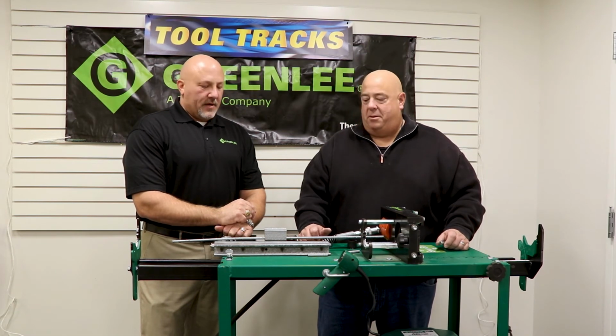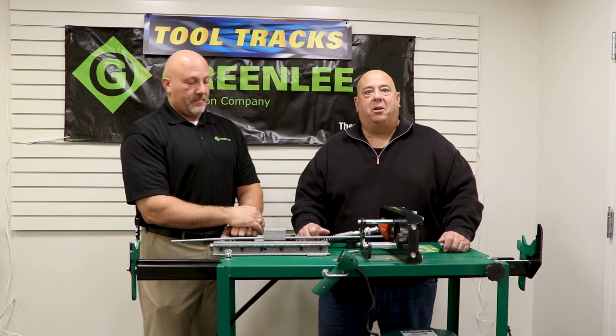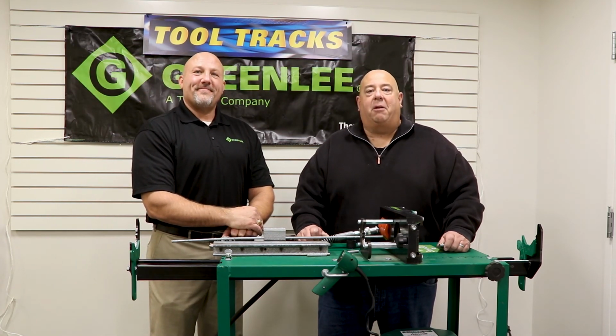We do. We have coming out in the new year, we're going to have a die that's dedicated to angle iron. So it will allow you to cut up to 2-inch angle iron, as well as some dedicated dies for rebar, up to 1-inch rebar. Great. Adds more versatility. It's going to save you some money. Featured on Tool Tracks coming up here in February.